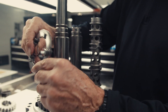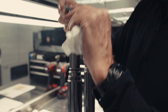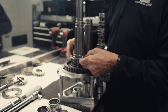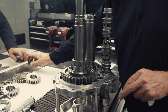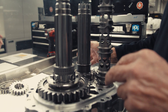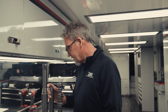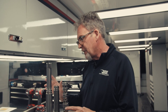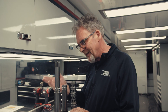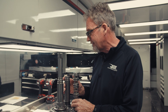Now we have the dog ring. With this gearbox, we don't just run one, two, three, four, five, six, by the way — this is a six-speed gearbox. Because this is run and controlled by a barrel system, we can't change gear that fast if we have the same gear ratio on the same slot of the barrel.